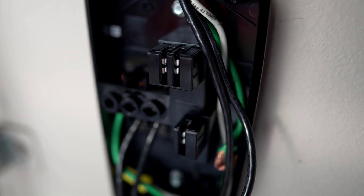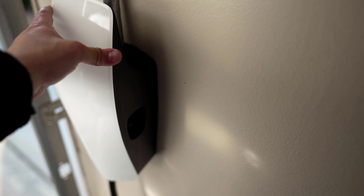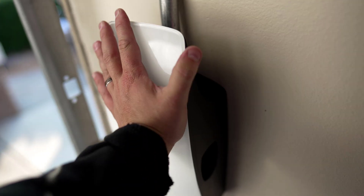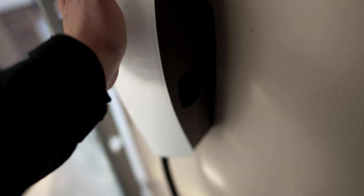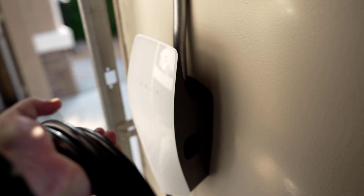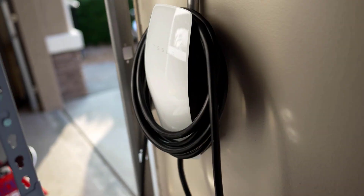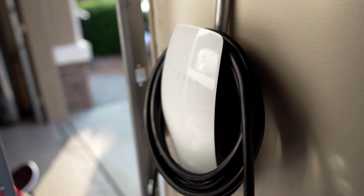The rest of it's pretty easy. Everything just slides back on and then you have two screws at the top and two screws at the bottom that lock the whole unit to the wall. Those four screws that attach the main unit to the electrical housing were a son of a gun to line up — I was actually pushing my whole body weight on the charger because my wall isn't perfectly flat. But now that it's all in, it's super sturdy. Last but not least, we can hang our wire over the top of it — super nice and clean, great cable management. Now we're ready to flip the breaker back on.